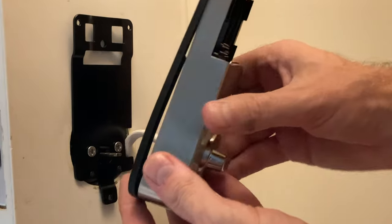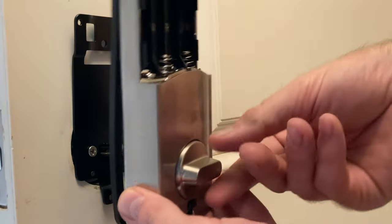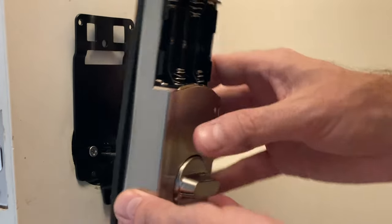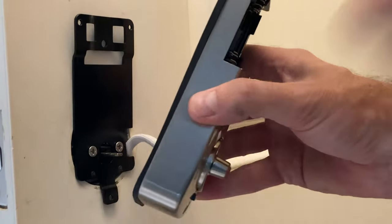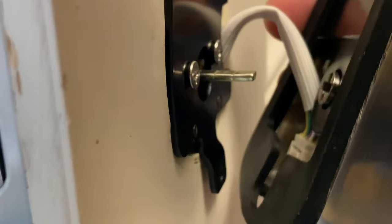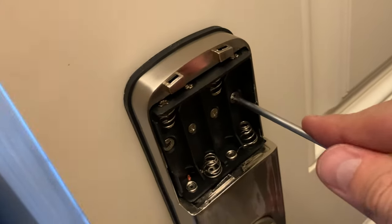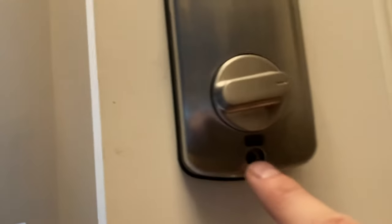Because this is a left-handed door, the deadbolt lever needs to be horizontal. Right-hand doors require it to be vertical, according to the instructions. Now slide this interior piece in - it has to go through that center screw. The cord will sit back in there, and we'll put two screws in plus one set screw.